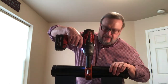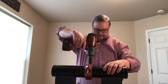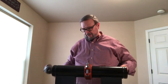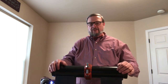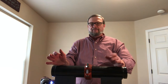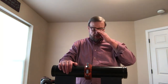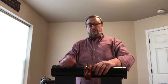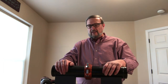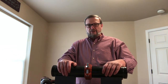You're going to work each side. We're down about 1/8 inch on each side and there you go — you're finished. Just that quick, just that simple. No taking the coupling apart and nothing else to do. You can actually slide this onto the pipe and slide more couplings on, then run your pipe up to wherever you're putting it and simply slide the couplings down as they go into whatever connection you want to make.